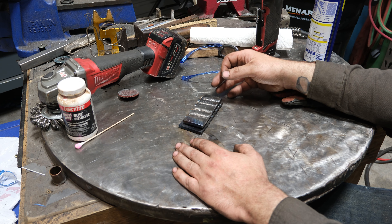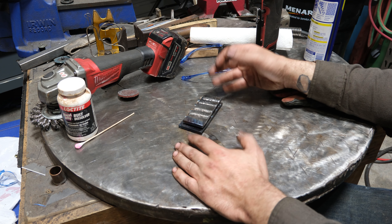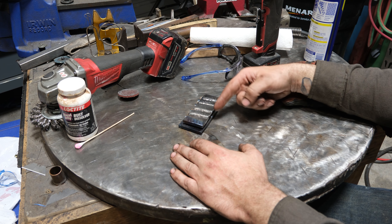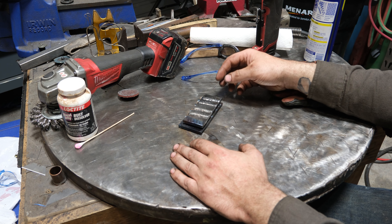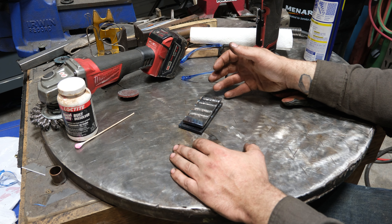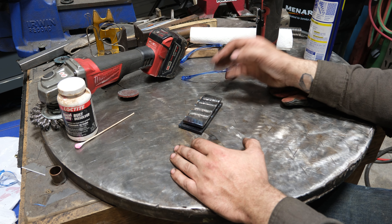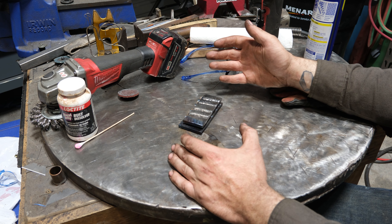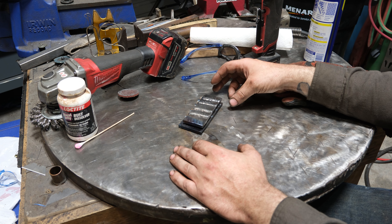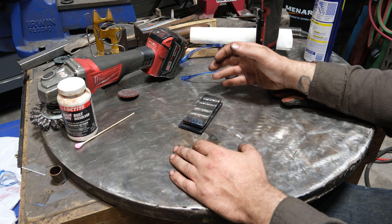I'm only doing flat plate today, but I know from past experience that fillet weld results on DCEN are even worse — because in a 90-degree corner, the weld is confined to a smaller area, so you're welding through an even thicker molten pool, which further limits penetration. That's why 6013, especially in 1/16th rods, is commonly run DC electrode negative — it limits penetration and can help you avoid welding holes in sheet metal, even though it's still not easy.